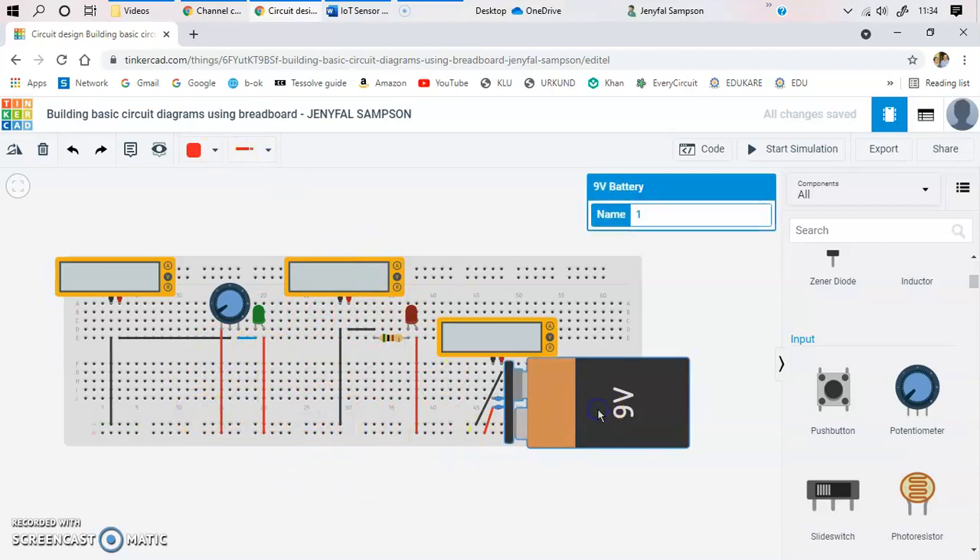Those are the key things to know about a breadboard. You know about the 9-volt power supply and the multimeter with its three readings. An LED is a Light Emitting Diode — it has two terminals: cathode and anode. The anode is connected to the power supply and the cathode to a lower terminal device, not necessarily ground but lower than the anode. The anode should be given a higher potential so the device becomes forward biased, which allows current to flow and light to glow.